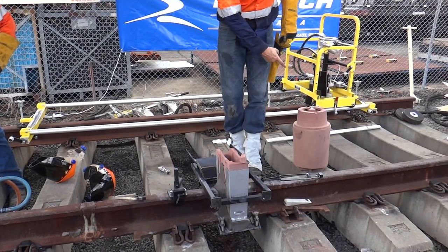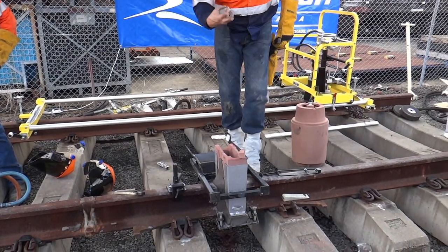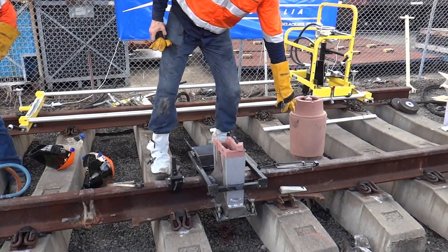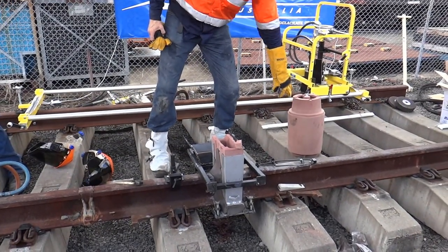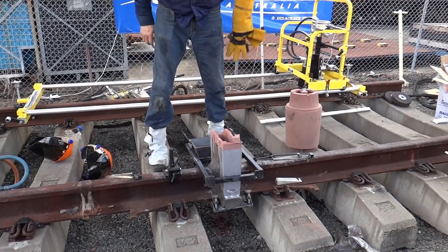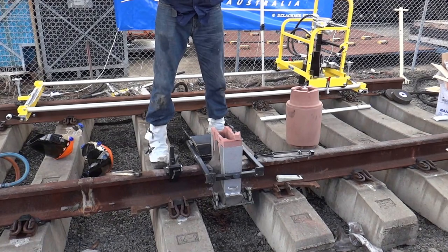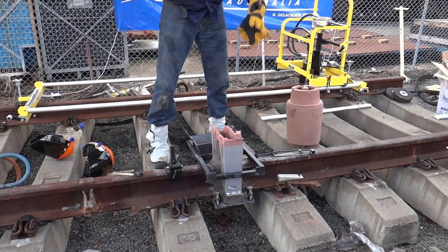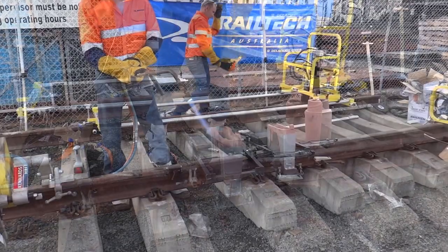Igniter ignites a small portion of material in there, which then starts a reaction, an aluminothermic reaction, with all of the iron oxide and aluminium in the crucible. It pours in, gets up to over 2,500 C, and melts the rail ends away. It just sets and then takes about 5 minutes, and then we seal it off like it is.